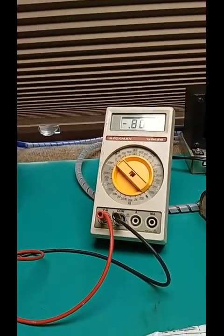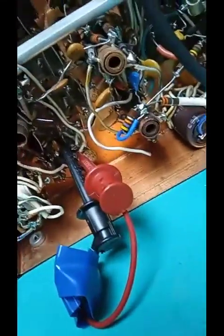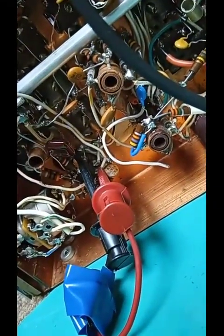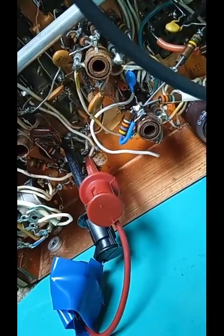It's that tricky. For the injection couplers, start on 40 meters. Adjust T3 top after putting the alignment load from V1 pin 6, which is a plate, to ground. And that's a little hard to see, but there's a ground wire to the socket for the filament, for the black, and the red's on pin 6 at the ceramic capacitor for the plate.